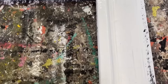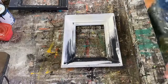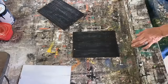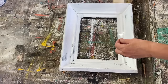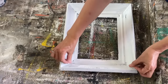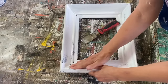I've kind of not put paint in every little corner — some I've left a little black peeking through — and I'm going to work away on the other two frames. I'm also going to paint the middle pieces and put a little bit of wax on them, then paint with the white chalk paint. Now I'm going to use the packing tape. When you press it down into that white chalk paint with the wax underneath and then tear it off, it pulls little bits of paint away and gives it that really cool distressed look.